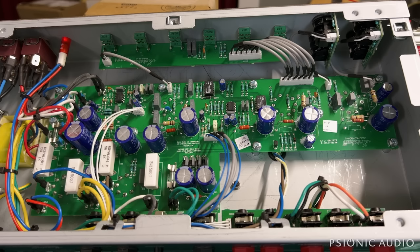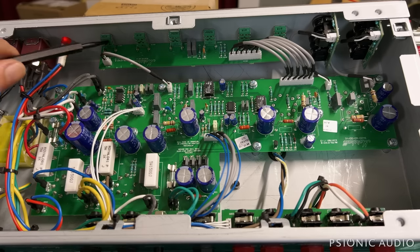I think one of the hooks to this is that this is supposedly a UK amp versus the import amps from, like the Origin series. But a lot of this stuff just says made in Asia, might have been final assembled in the UK. In positives, the majority of the resistors are metal films of suitable quarter watt or half watt. Not great, but okay. The plates tend to be these 1 watt carbon films, which are good. The droppers are these 2 watt Vishay metal films. I use these same resistors in my amps.